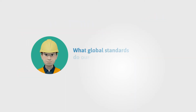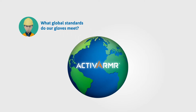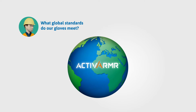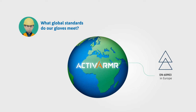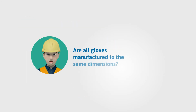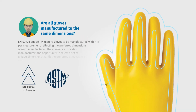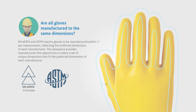What global standards do our gloves meet? Ansell electrical insulated gloves adhere to two global accreditation standards, which include EN 60903 for Europe and ASTM D120 for North America. Are all gloves manufactured to the same dimensions? Gloves are required to be manufactured in accordance with EN 60903 and ASTM measurements, which allow manufacturers to select a set of unique dimensions that fit the preferred dimensions of each manufacturer.